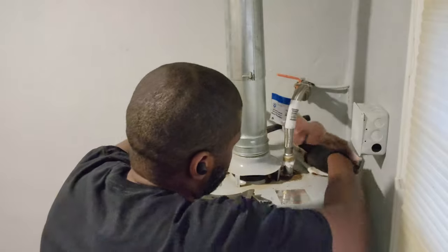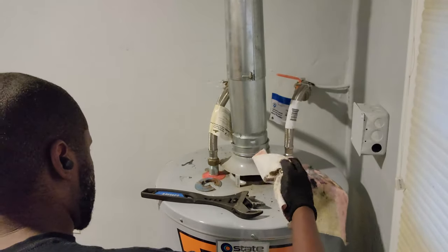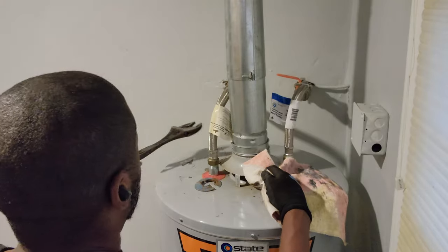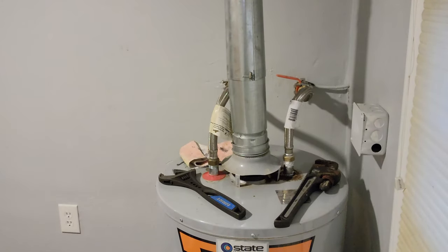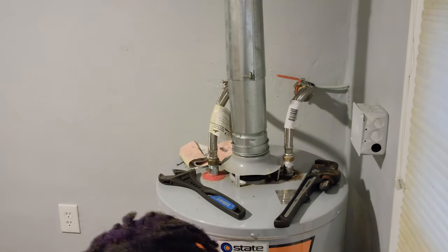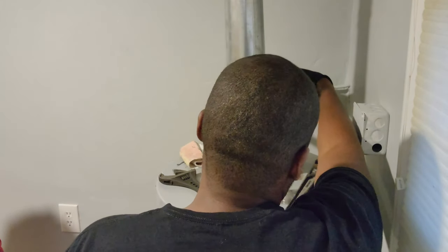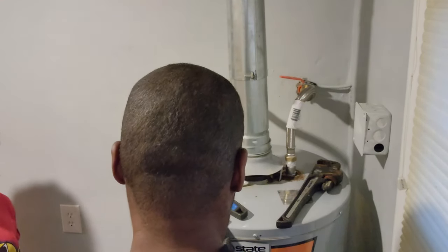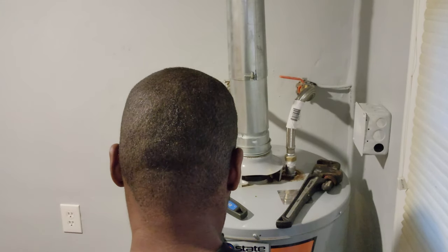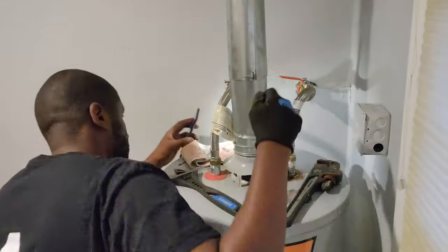After tightening, I cleaned up the rust around it. The last thing I need to do is check for any leaks. The water valve is still in the closed position — I want to check there first so that if it leaks, it'll only leak at the top connection and not both top and bottom. I had my nephew go ahead and watch it, and there were no leaks. So now I'm going to turn the water valve open so water actually comes inside the water heater, and then I'll start checking for any additional leaks.